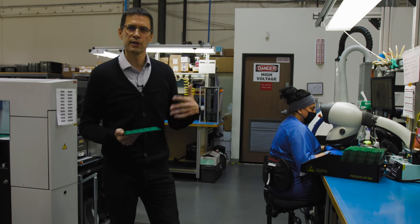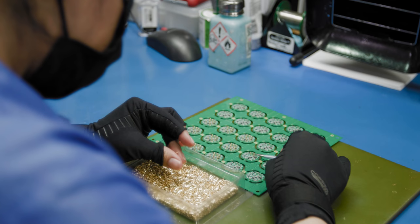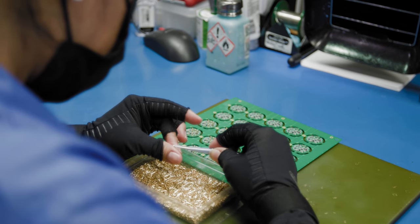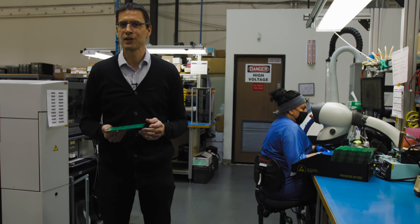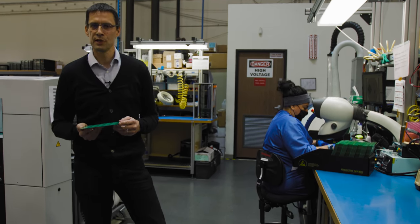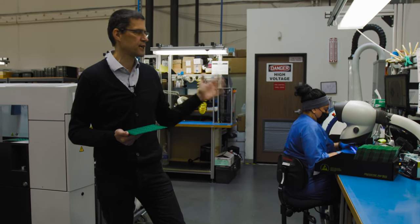After the reflow oven, we do a quality check where everything is inspected 100%. The PCBs are the brain and heart of the flashlight — that's where we put a lot of effort. We do the CPU boards and the power boards, and everything gets tested for correct layout, correct parts, integrity of the check, and correct soldering. Everything is done in-house at Surefire.